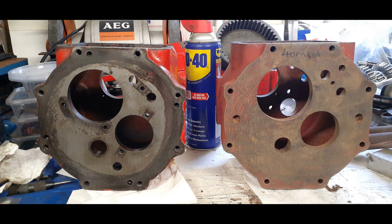Darren at Mead Plant sent me a casing all the way to Australia, but you might want to play spot the difference with me here. There are some threaded holes next to these bearing holes, and they're used to secure features which retain the bearing so that they can't fall out into the reduction gear housing if you have that. The standard gearbox doesn't, and that's why they're not there.